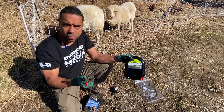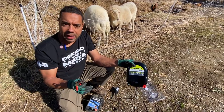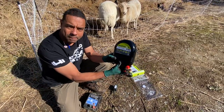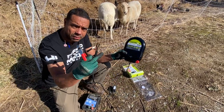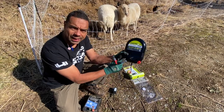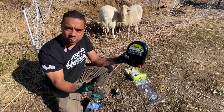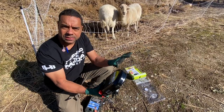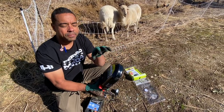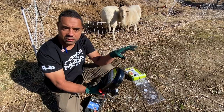To make this thing operate on DC, I just take my leads — black is always negative, red is always positive — stick them onto a battery, run the black portion to a ground rod, and run the other part to my fence. I know a lot of people haven't done this sort of thing, so I'm going to walk you through every single step of the way right here in the barn where I'm going to mount this thing.